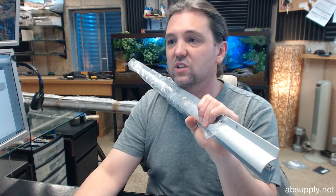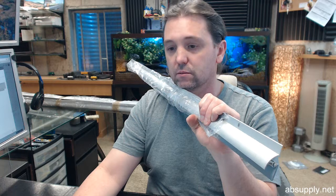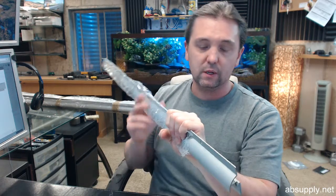Now, the fact that this item has a drip cap is what sets it apart. People who have installed drip cap items, either door sweeps or drip caps above the header, will all attest to how remarkably effective they are at helping keep water away, especially above the header. National Guard has a 2.5-inch projection and then the typical 9/16 projection for drip caps above the header.